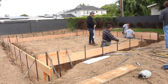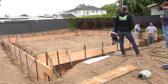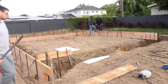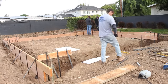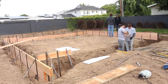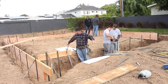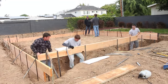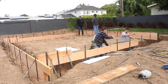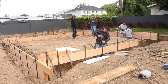Here are your return stem walls. As you can see on the outside form, there's a garage door opening on both sides — kind of a drive-through, but the other ends are dead ends. You can see that property line block wall back there. Basically this is just going to work as a ventilation breezeway through the garage, which is nice in this area because you're going to get a nice ocean breeze and won't have to worry about heating or cooling.